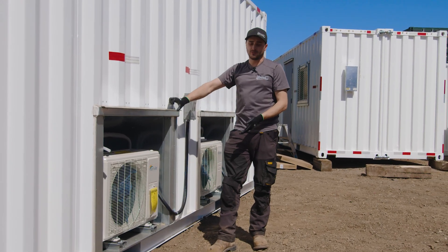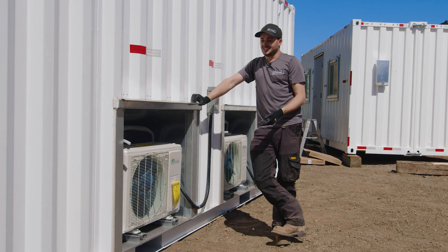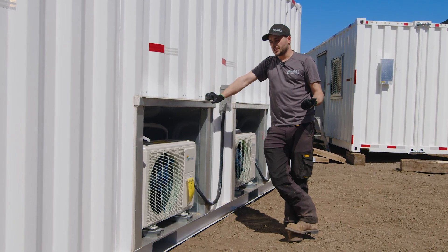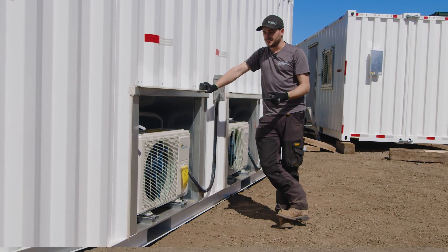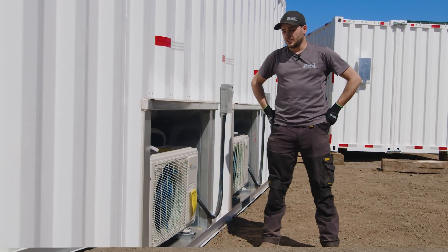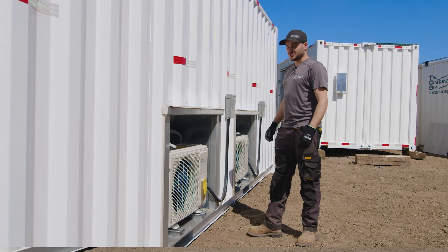In northern climates, these only work down to about minus 28 Celsius, which is insane. You do kind of want some sort of auxiliary heat — like a wood fireplace, or just keeping your furnace. But where these things really shine is from 10 degrees Celsius down to minus 18 degrees Celsius. Instead of using traditional air conditioning or burning natural gas to produce heat in those instances, heat pumps are the clear winner for efficiency, even if natural gas is way cheaper than electricity right now. That's going to change with carbon tax in Canada — natural gas is going to get more expensive every year, and these are going to become cheaper and cheaper to operate compared to fossil fuels. So we love them.